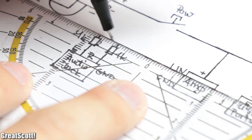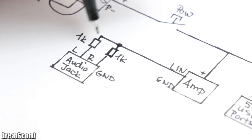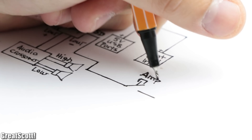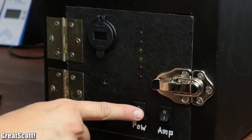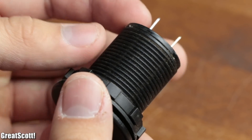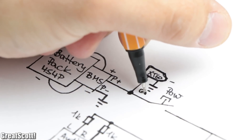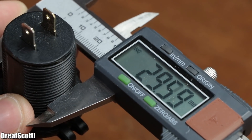The amp's input is connected to two resistors which turn the stereo signal of the audio jack into a suitable mono signal. The output of the amp is then connected to the audio crossover, and the crossover to the loudspeakers. Additionally, I connected the SD pin — aka the shutdown pin — of the amp through another switch to ground, so that we can turn off the amp separately if we for example only want to charge up our phone. Speaking of charging, I got a 5-volt USB charger module from Amazon rather than building one. Last but not least, there's an XT60 connector so that we can charge up the battery pack.